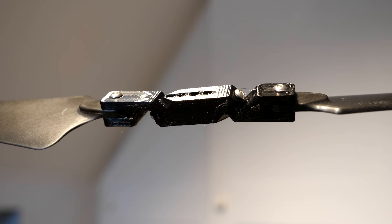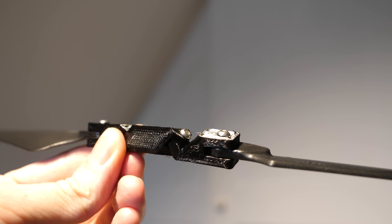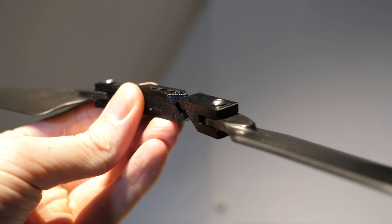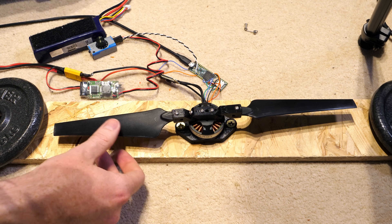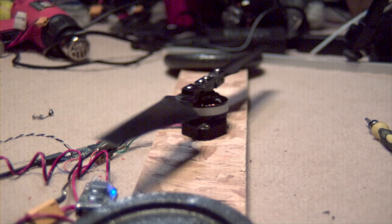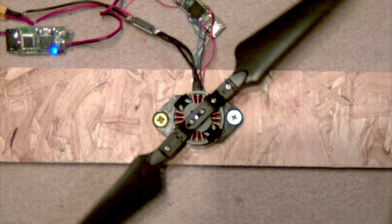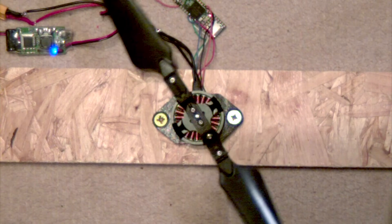The next step was to make the rotor head with the angled hinges. Moving a blade grip forward increases its angle of attack; moving it back decreases it — the reverse occurs with the other blade. But when I mounted the rotor head onto the motor, I didn't see any significant pitch changes throughout the rotation. At high RPM, the outward centrifugal force increases friction at the hinges so much that they refuse to move.